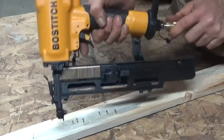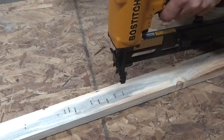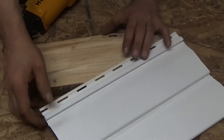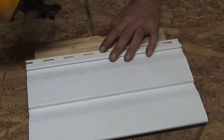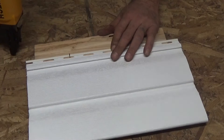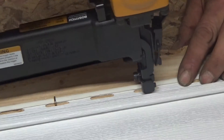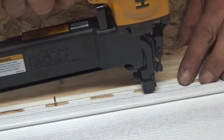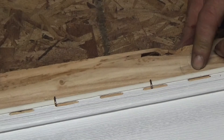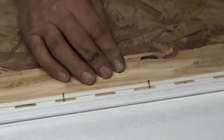Connect the air and let's go! I like to use it with single shots — I think it's safer and easier for me. You should always try to shoot the staple in the middle of the hole; only then can the vinyl siding move in both directions if the sun shines on it or if it gets too cold. I'm sure with a little training it will work, and the important thing is the vinyl siding can move right now in both directions — and the staples don't stick out at the inside.